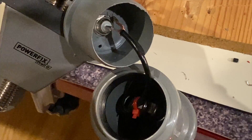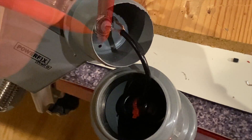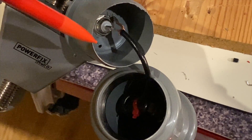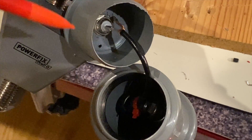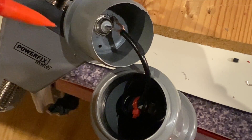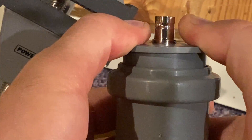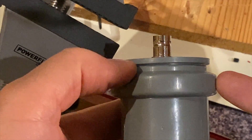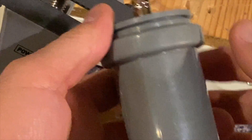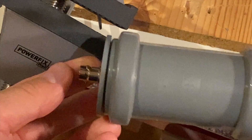The second cap is finished. You can see the small hole in the bottom of the second cap — this little hole is designed for moisture to evaporate and to prevent condensation of moisture within the balun. It goes in pretty tough and this is good. It means the rubber band inside the case helps to get it more or less insulated from moisture.